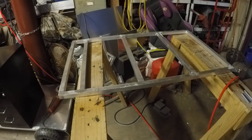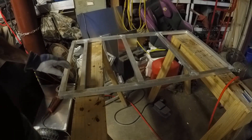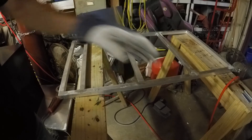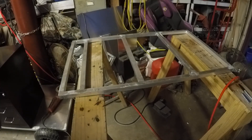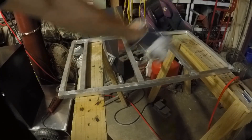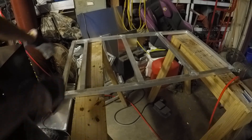Back to it — this is the top frame. Showed you the bottom frame, the plate on the bottom frame, the wheels on the bottom frame, and so now this is the top frame. This is what the actual welding machines are going to sit on. If you look at it, it's basically 40 inches long, 36 inches from here to there — 36 is actually going to be the dimension of the top. We're going to put plate cover from that end to right here.